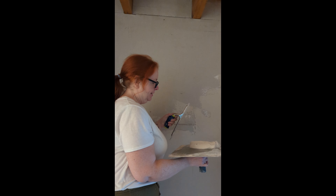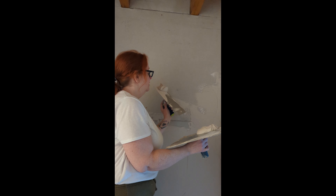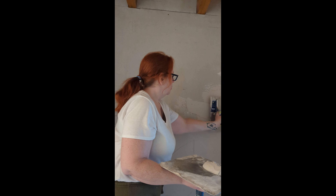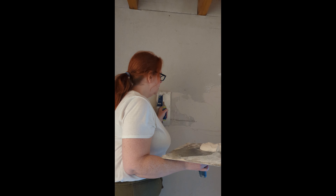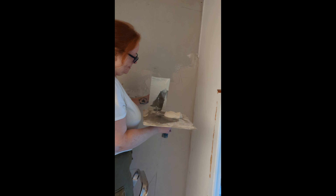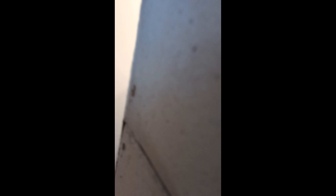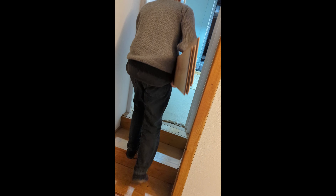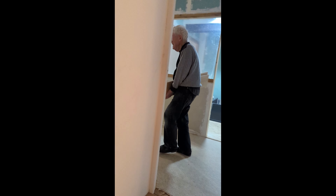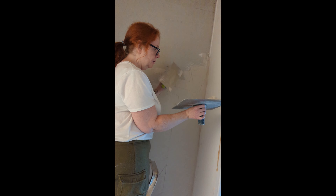Doing this for a living, people end up with knackered knees because you continually go up and down. Mine are already knackered. My father-in-law has actually had two knee replacements - he was an apprentice-served master plasterer, and that's who taught you. On a sheet of plasterboard you've got a chamfered edge, so when you join them you put the chamfers together which leaves a dip, and then put the paper or scrim tape in the gap, and then you plaster the gap first before you do anything else - so the plaster in the gap goes off and holds the tape in. Which is what the mudding is.